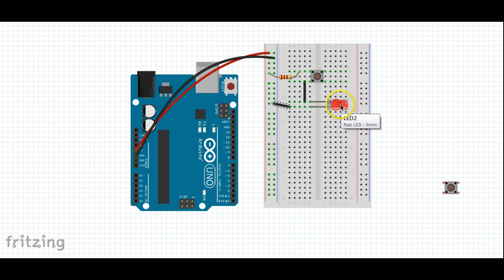Now let's go ahead and add a second switch. We're going to move the LED. Bring your second switch in. Make sure again that the pins are coming out from the right and left. Connect it up to the spot where the positive side of your LED was before. And then let's bring your LED and mount it lower on the board. Now we'll bring a wire from the bottom of this switch over to the positive side of the LED. And then connect the other side of the LED to ground. And there we go. Now look at what happens. See how this behavior is different?